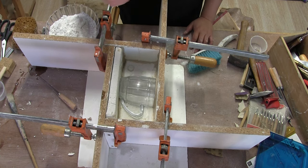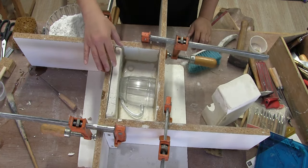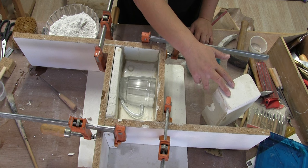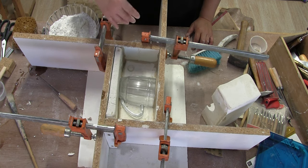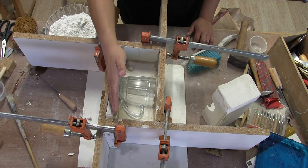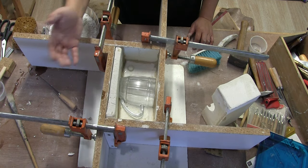If you want to make an additional set of molds and you already have your three pieces, you can pop one piece out and recast that section. You could work in reverse and recast a second set, ending up with a full second duplicate mold. So now I have this opening — I'll cast this second half, then flip it over, cast another bottom piece, and I'd end up with a second duplicate mold of the whole thing.